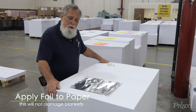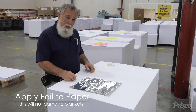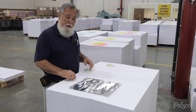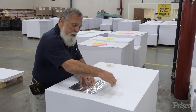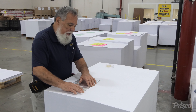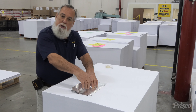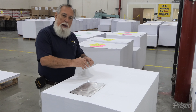We're going to start this process by applying a piece of aluminum foil to a sheet of paper. We're then going to run that paper through the press and coat it, but we're not going to print on it — so we'll have our printing units turned off. I'm going to put this foil off to one side of center because I don't want it to interfere with the double sheet detector. Once we get that foil folded over itself, that's going to allow us to coat just the top side and not the bottom side. We'll tape that down.